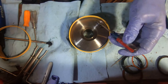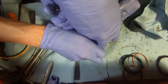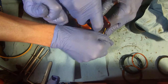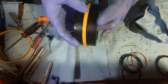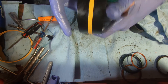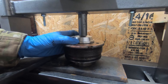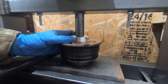Now that we are done removing the outer seal we're going to be pulling on this one — it's extremely tight. The best method we've found is to grease it up real well and put multiple screwdrivers and tiny picks in there, then use them like tire spoons to get it on the rim and then push it down by hand. You'll see it's actually a little wobbly on there — I don't see how you could get it on there without putting that much play into it by flexing it around. Either way, we've never had an issue when installing them correctly. Now we are back at the farm finishing putting in the wiper seals. We start off by finding the correct size driving disc from a bearing and race driving kit, then put it on the press and gently push it in — they actually get recessed in there quite far.